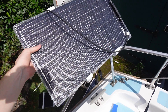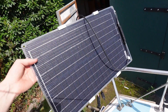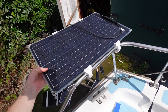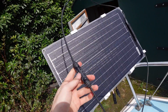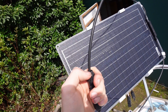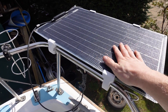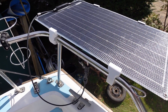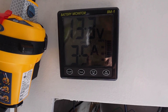All I have to do is adjust the tightness because when it gets to horizontal it wants to drop, so I just need to tighten these up a little bit. You can see the full range of motion - that's probably about 80 degrees and then 90 degrees at the other side, so I can take full advantage of the sun when it's setting. I'll have to shorten these wires up a little bit as they're a little long. I'll shorten them up, crimp on a fresh connector, click it into the housing, and add on the little waterproof grommet. Then I'll mount the other side.